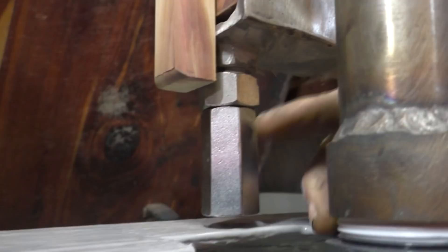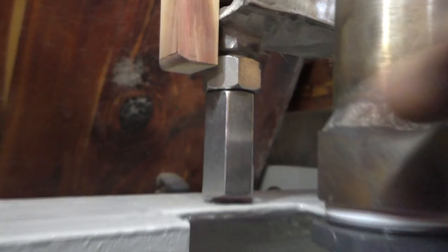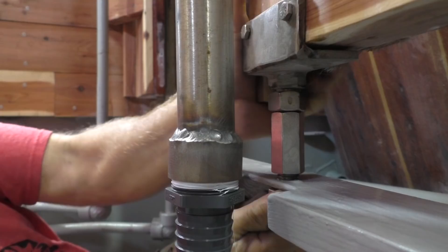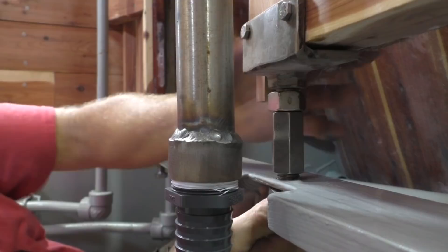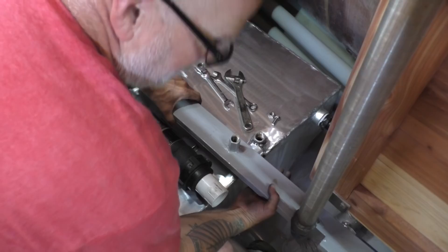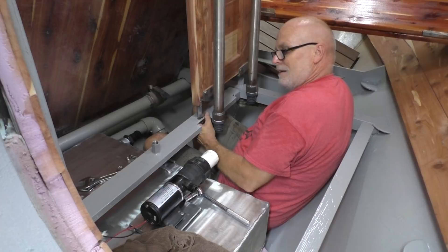There's a piece of all-thread in here that's welded to this plate that's bolted to the wall of the bathroom. What I did is cut that stud off shorter so that I can take a cut-off bolt and run it up through there — that'll make this thing completely able to be disassembled. That's one of the things I feel really strongly about in boats: you ought to be able to take them back apart without having to use a chainsaw. It turns out the hold-down bolts have to go in place first, then the beam. When we're on the water, we can just go back and look at an old video and say, oh yeah, that's how you've got to do that.